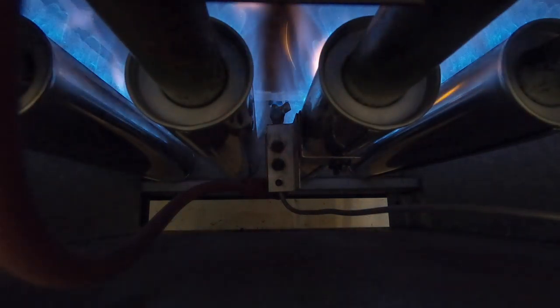How it works, but the zone should be opening. Here we go. Spark it away. Where did you guys get to see in there? Now I turned them off. I'm curious if the pilot's lighting. This is the only way I'm going to be able to see if it's just sparking, if it's lighting or what. I should probably put my meter on it, but I want to see what the pilot looks like with the door on.